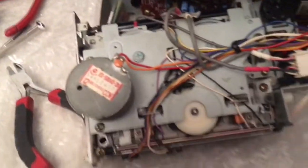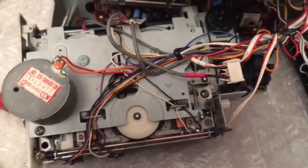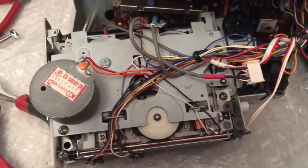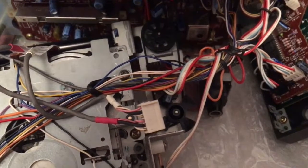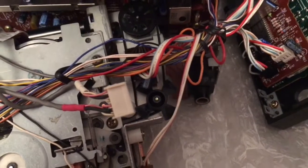We've got a Sony CFS 9900, which is the same as the CFS 9000. You can get the camera to focus. This one has new belts, which I got from a chap on eBay — I'll put a link in the description. He's also sending me a counter belt, which is the one that runs to the counter at the bottom and also runs that little fan, which is actually a sensor.